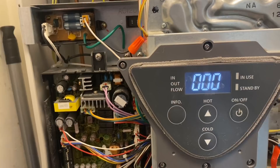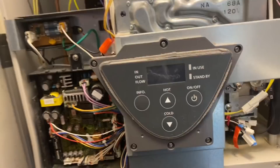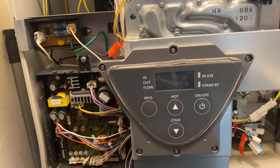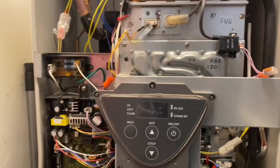Reading the manual — error 991 refers to incomplete combustion. On the phone: it indicates improper air-fuel mixture, which could be caused by blockages or obstructions in the venting, an issue with gas supply, or — especially on an older unit — a dirty burner.